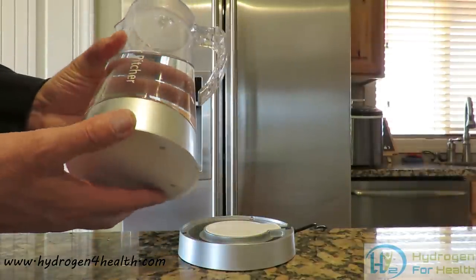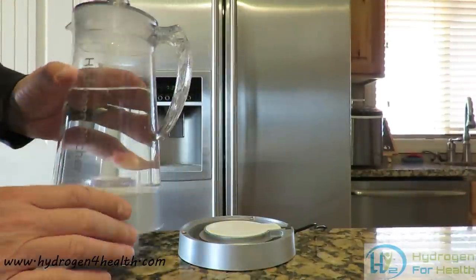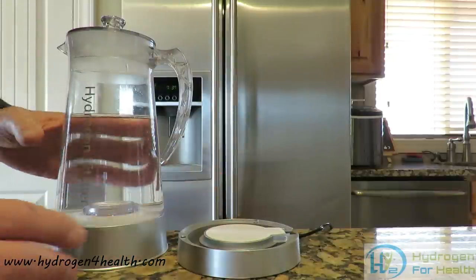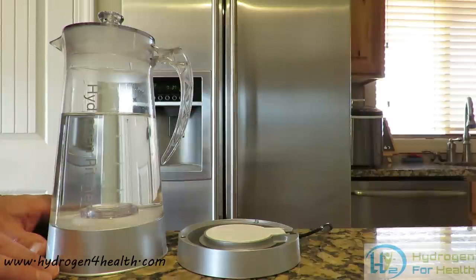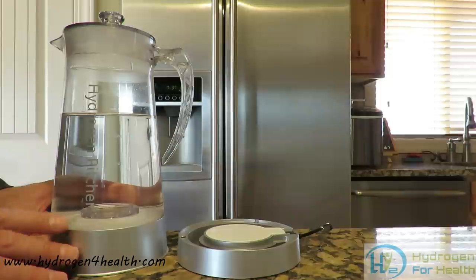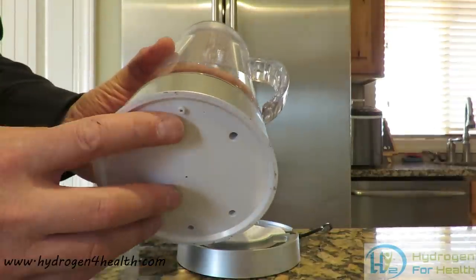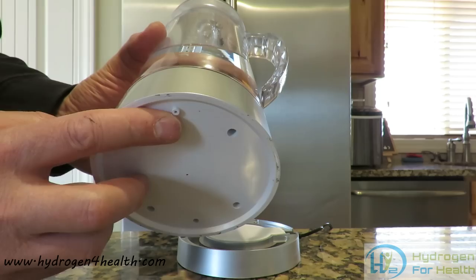The bottom here has a small hole — this is where the oxygen escapes out the bottom of the base. What also happens is on your positive plate where the oxygen is produced, you will also produce chlorine, ozone, and other byproducts. So if your water has any chlorides in it, which is any salts that most water has, the salts will be changed to chlorine on the positive plate. Also ozone is generated on the positive plate. Now remember we have that barrier there that separates the two. So out of this hole the oxygen, chlorine, ozone, and other small byproducts will escape, plus any waste water.